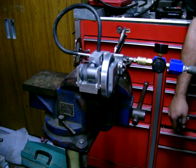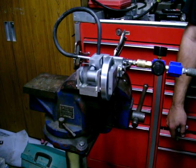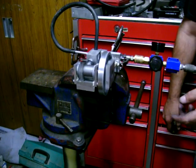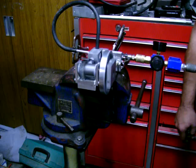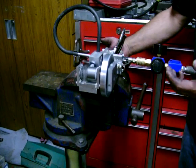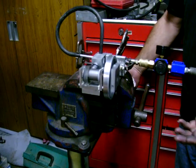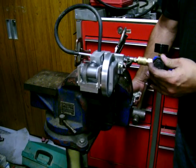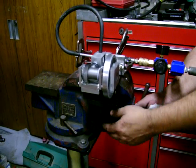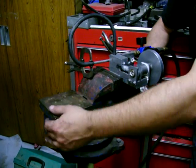The valve timing is very difficult to find on this little engine. It doesn't want to stay running because the little flywheel doesn't really weigh enough to keep inertia in between the power pulses. But the way it's set up, it's doing one pulse per revolution. So I'm going to go ahead and turn it back down. Which basically turns it into a two-cycle engine — that's pretty much what it is.